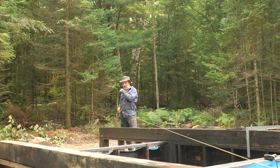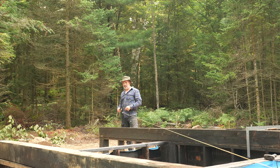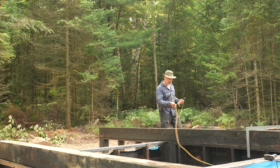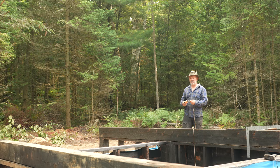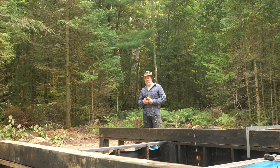I'll have to drop that timber down a little bit, probably half an inch on the outside pillar, in order to get that timber level. I'll do that now, and then I can start doing the floor for this section. The reason I want to do that is I want to maintain that square. The best way to do that for me would be to get these floor joists in place and have those hold these timbers square while I start fastening up through the bottom into these timbers, through the top plate of the basement wall. That way I can make sure everything's secure, and then it won't move.